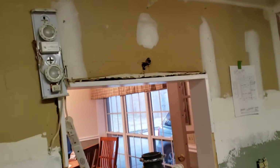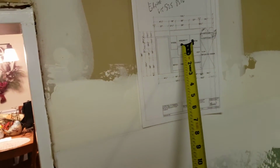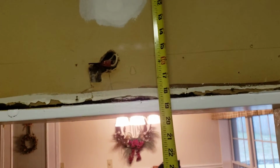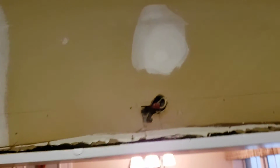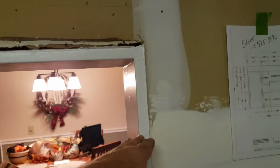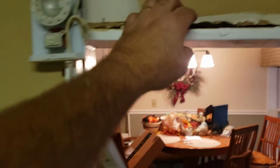The other thing is on the work order we have today, there is a wall 3624 in the design. If you look right here, the spacing from that soffit to the top of this is around 18 inches. So probably a 15-inch cabinet is what we're going to need for the top of this, a wall 3615 with a matching interior, so the bottom of it is white. And that way, because what we have is a 24, that's going to be hanging way too low on this set.